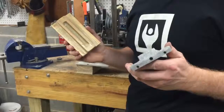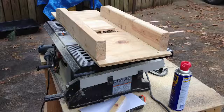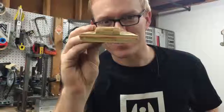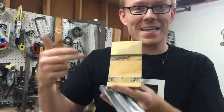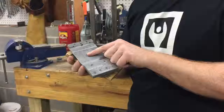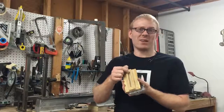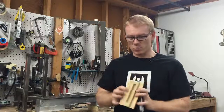This is the carriage casting — the foundation for the entire carriage assembly — and this is the pattern I used to cast it. I made this pattern on my older table saw. I've got a little sled for it, and that allowed me to cut the channels down this part. You can even see some of the saw marks where you can tell that I nibbled away at the pattern. I made the end parts by cutting about a three-quarter inch piece of plywood just to fit down in that slot.